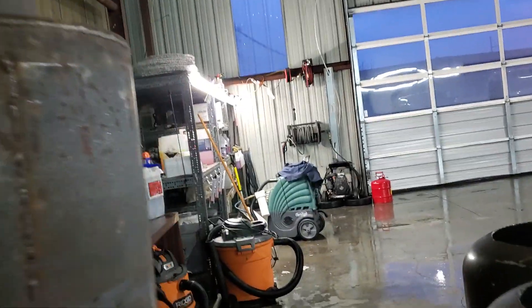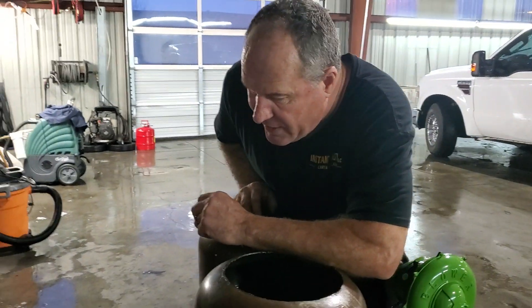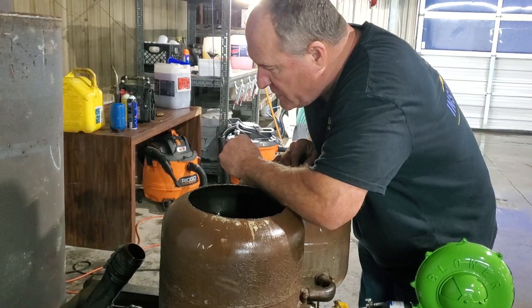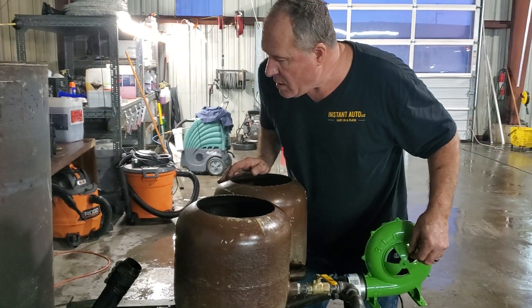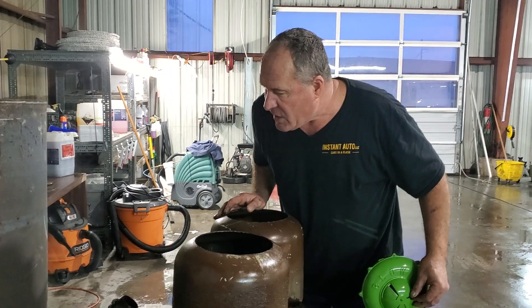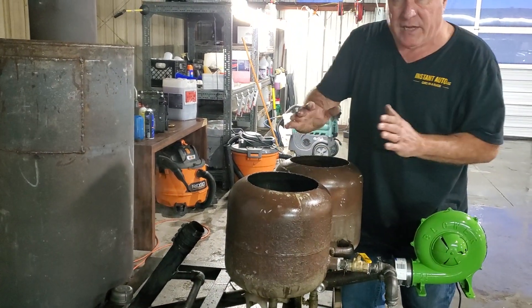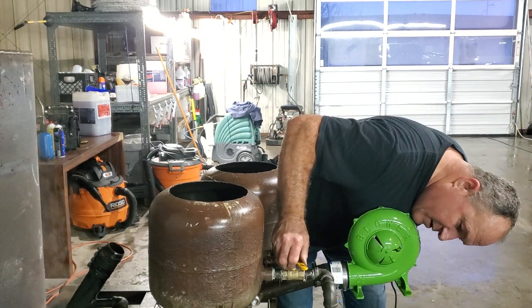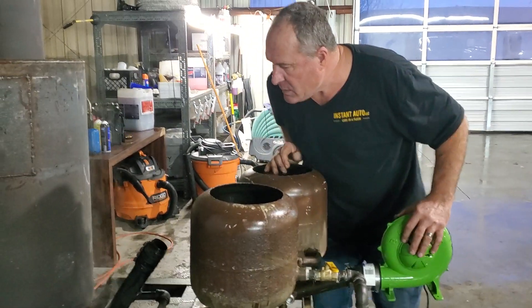You can go down to the tube and see what's going on. I don't have much air going in right now, but I'm already getting some heat off the tank. You can see how the oil is blowing around and mistifying a little bit. Once I add full air to it, you'll really see it — it's crazy. I can see the fire going down just a little bit, so it hasn't gotten quite hot enough yet. I don't want to go to full oil yet; you've got to regulate the oil and the air. But once things get really running good, you can crank up the oil and crank up the air. I'm going to cut the oil down just a little bit and let that get a little hotter.